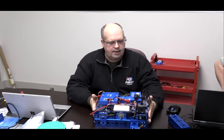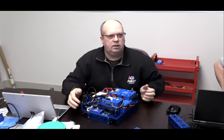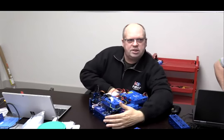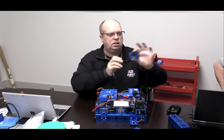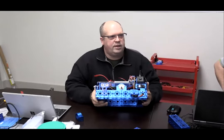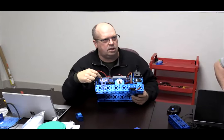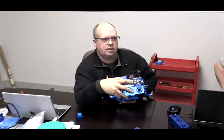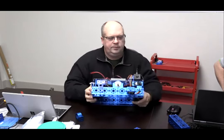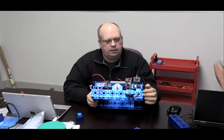With our electronics, we put the frame together, with the battery underneath on one side so that we can see it. On the other side, we used the standard over clamp motor mount and mounted a motor to it. Then, very simply, on the front of the channel, we mounted the ultrasonic distance sensor. On this side, with the sensors together, we mounted the Sharp IR sensor. We also mounted a servo on this side using one of the front servo mounts.